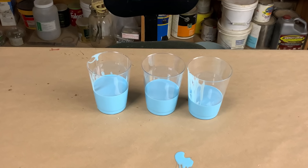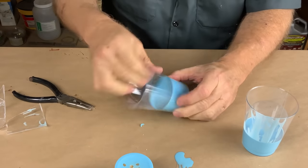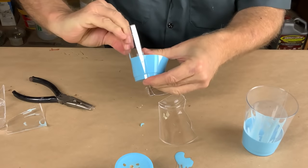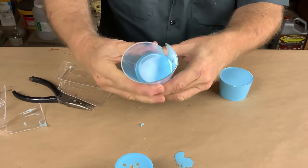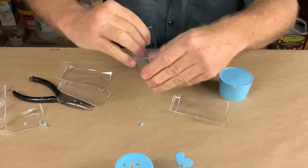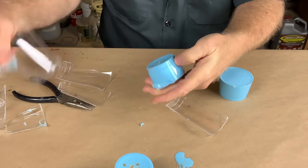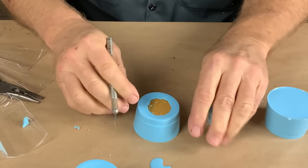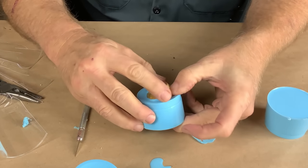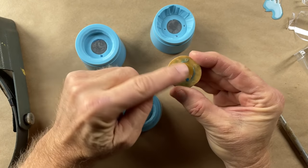Let's cut these cups open without cutting my fingers open. I got the wood plugs taken out and I popped the sculptures off the bases very easily. Another advantage is sticky wax as opposed to hot melt glue — sticky wax holds strong but pops apart easily. That's why I love wax for this purpose.